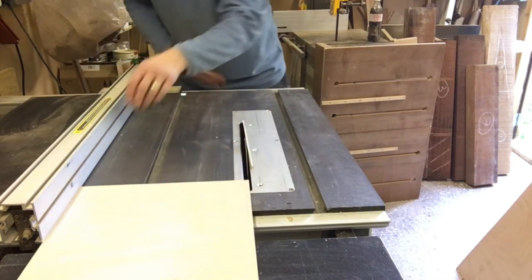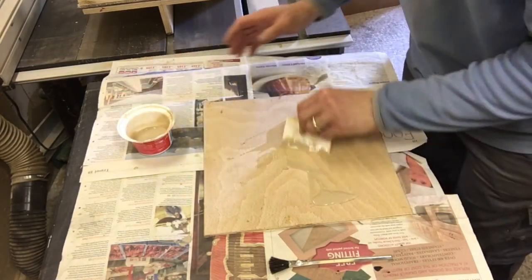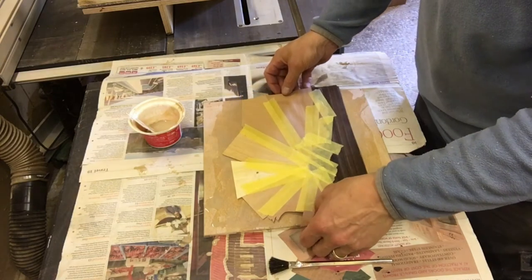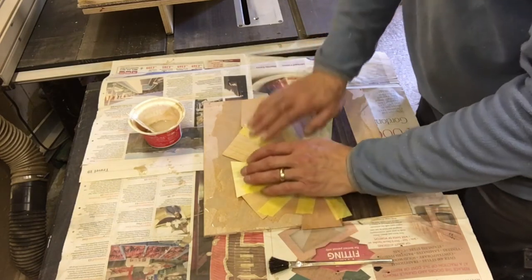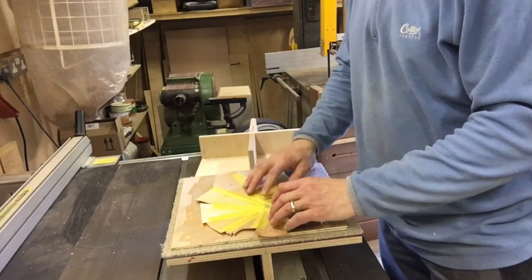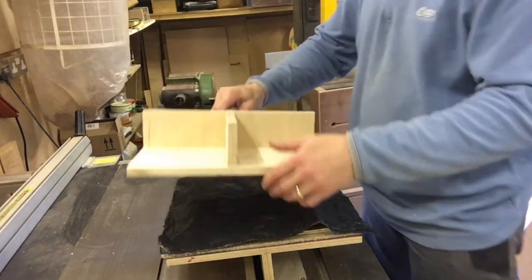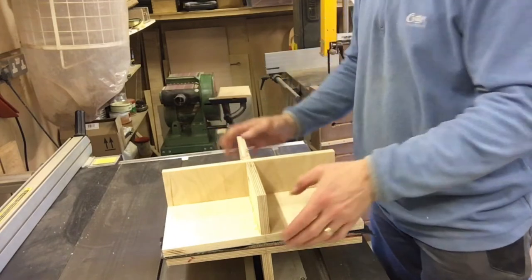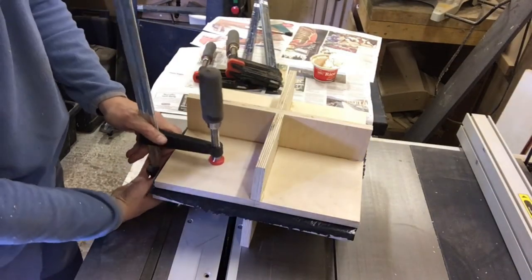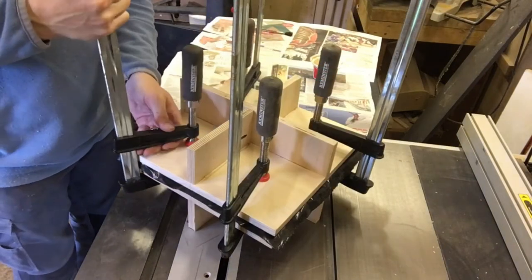I then mark out the shape of the lid on the marquetry and cut a piece of plywood oversized. I then spread some cold pressed veneer glue onto the pieces of plywood and lay the marquetry on top. I put the sandwich of plywood and veneer into a shop-made press. The press comprises two stiffened plywood sheets, and I use a carpet pile on one side to help spread the pressure evenly. To stop the glue sticking to the press I place a piece of polythene cut from a rubbish bag on top of the veneers. Clamps then apply pressure until the glue dries.